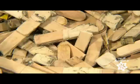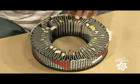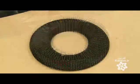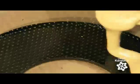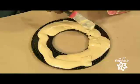They place a spacing stick inside each pleat. This is just temporary to size the pleat's width uniformly until they're cemented permanently in position. To do that, workers pour ceramic cement into a circular bottom plate made of perforated steel. The perforations ensure better bonding.